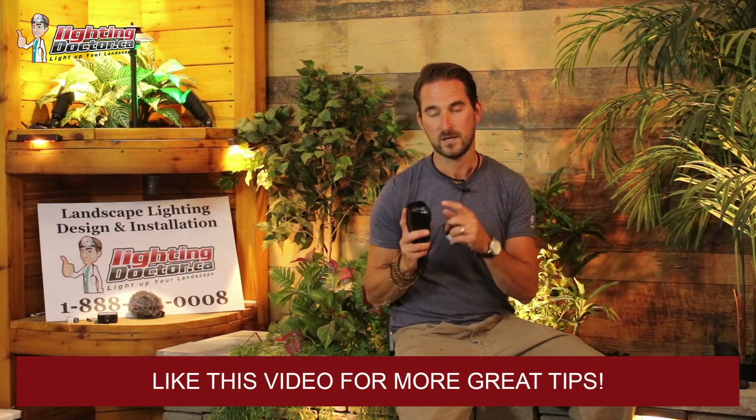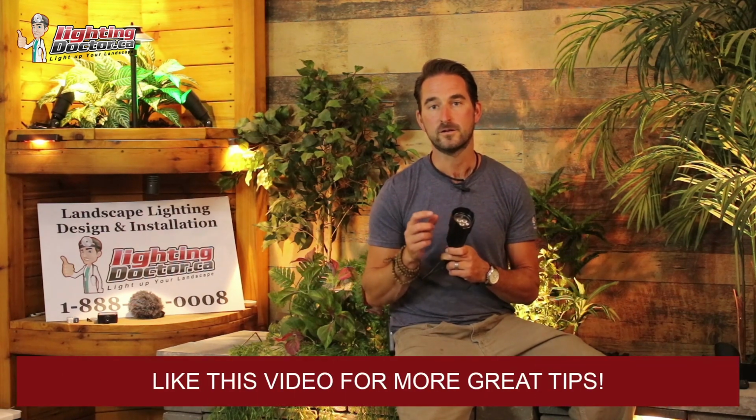You can change the intensity of the bulb just by using a different lamp. So if you have a small tree that's only maybe 10 to 15 feet high, you can use the standard 4-watt LED lamp in here. If you're using trees that are maybe 15 to 20 feet high, you can increase that to the 5-watt LED. Or if you've got some giant oak trees or some really big trees on your property where you need to push that light at 25 feet or higher, that's where you get into the 6-watt LED lamps to really push that light out and make those features really stand out.